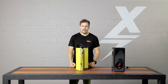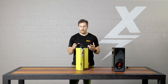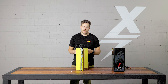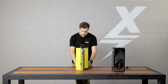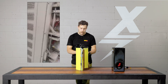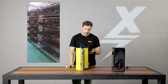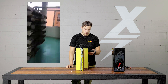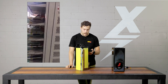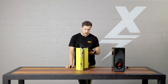One of the things we wanted to show you is how cells are chosen for these batteries. We don't just grab the first 20 cells we find and stick them together. These cells are actually measured and checked for voltage. We have them in the factory all hooked up side by side, and we basically try to pair cells with other cells that are as equally matched as possible. We lay them all out in racks, charge them up, get them equally balanced, and then pick the ones that are the best pairs.